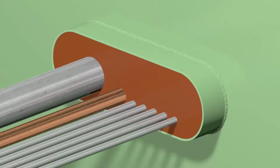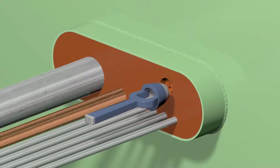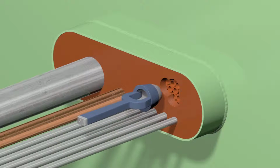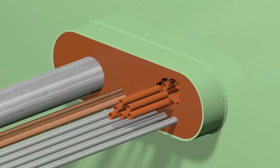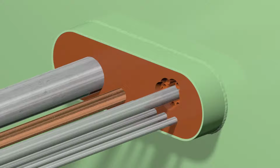Adding an extra pipe through a finished NOFIRNO multi-pipe transit is an easy job. Cut away the sealant layer at both sides of the penetration with a plastic knife or a hollow punch in a tapering shape at a spot where there is sufficient free space. Remove some of the filler sleeves to create an opening that is large enough for the new pipe to be ducted. The pipe is pulled through the new opening in the NOFIRNO multi-pipe transit.